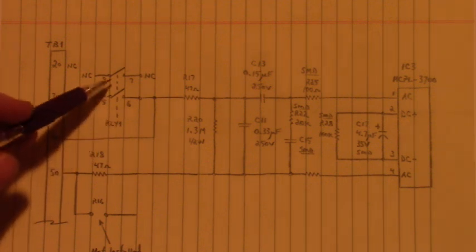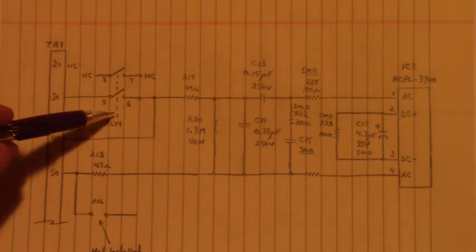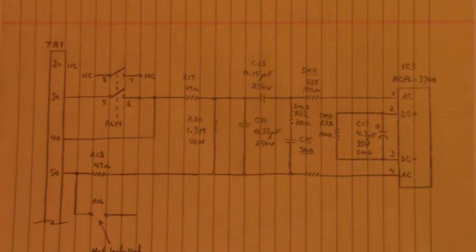Now what does relay 1 do? If we have an overcurrent condition with the SCR hockey pucks, or if we have a heat sink over temperature condition, relay 1 will open up and stop that drive from running. That motor will coast to a stop. Isn't that amazing? Okay, there is the circuitry for stop, start, and overload.